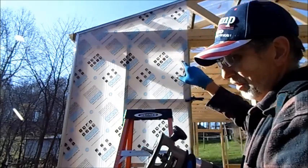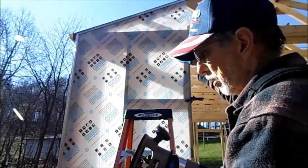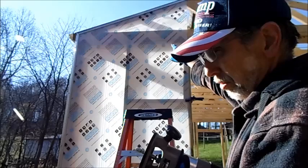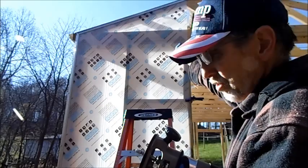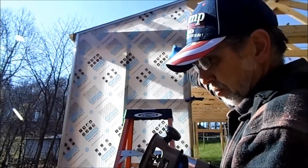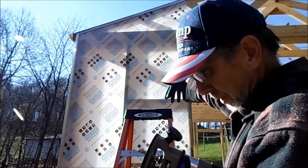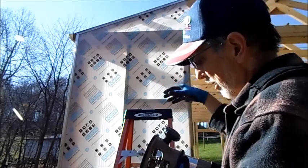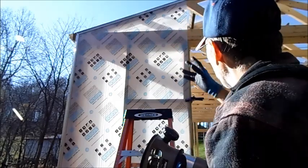And anytime you cut on the inside, you want to go clockwise. So, the reason I want to start at the top is because I'll finish at the top, and that way the piece that I cut out will fall away from the bit instead of stopping on the bottom and landing on the bit and making a mess. So that's what we're going to do.